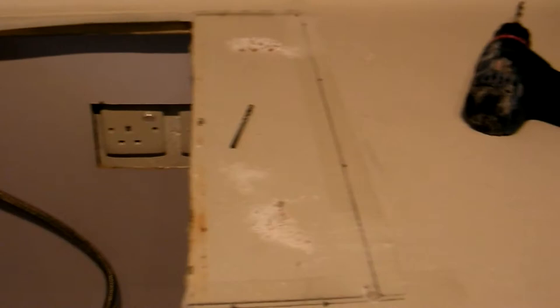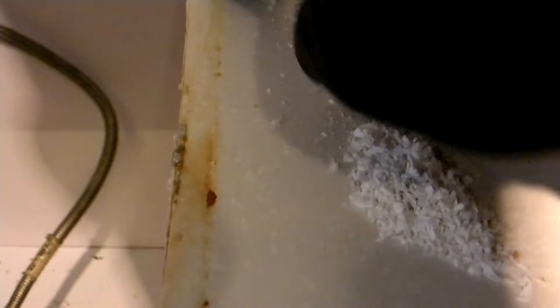I might get in there — I've seen a technique where you use ice, then crazy glue, then a hair dryer to glue this together. I might give that a shot and then sand it down, or might just move on to stuff that's a little more high priority. I drilled a pilot hole with a 4mm drill to just get my bearings, and then I re-drilled it out with an 8mm.